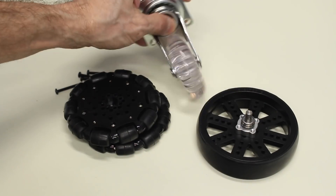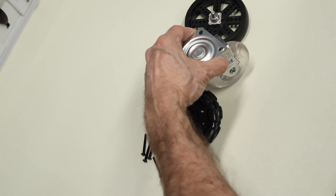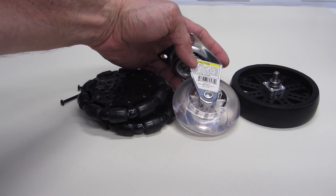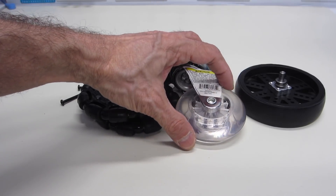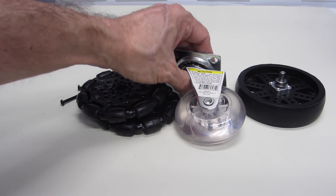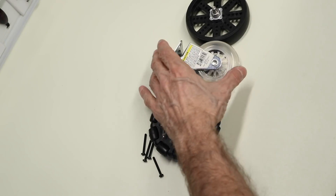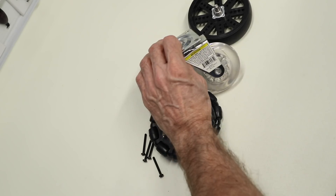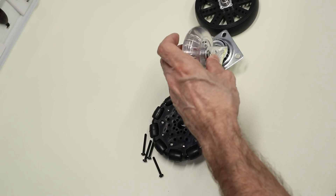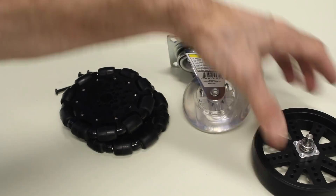This is a caster, which I didn't end up using in the final design. I originally wanted to use casters — they're inexpensive and can certainly do the job as a free-rolling wheel. However, casters can cause a problem navigating the robot because they tend to have a mind of their own. On surfaces like a throw rug, when the caster catches the edge it can cause the robot chassis to jerk to one side. Nonetheless, this is a nice heavy-duty caster made for robotics use.